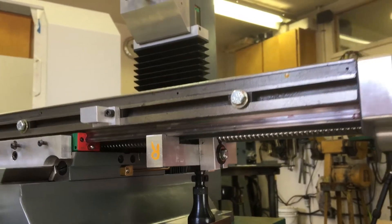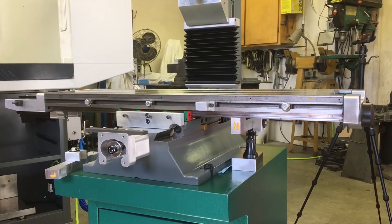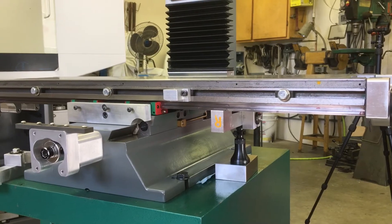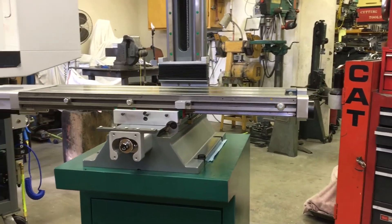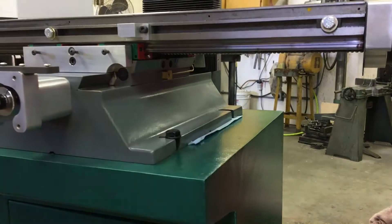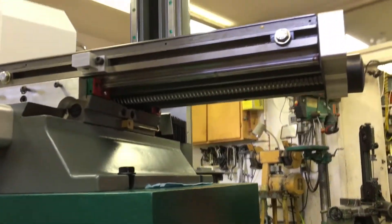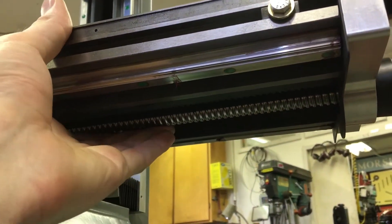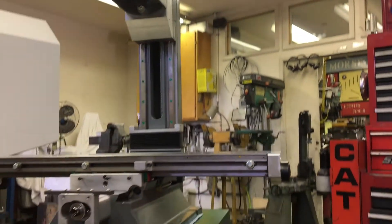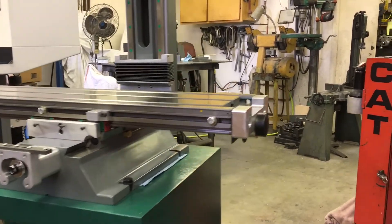It made things really easy. You can track the screw back and forth, but it's always nice to have a reference — I know what this should get me because I've done it before. After I got all the left and right side screw end plate things, and the center nut right here torqued down, it's still just as smooth. You can drive it with your open hand. It passes the non-scientific 'smooth from one end to the other' test.